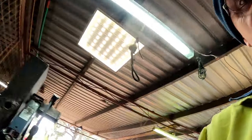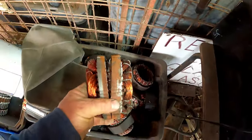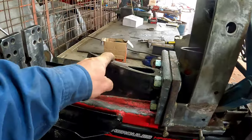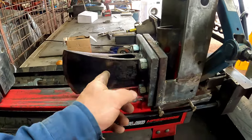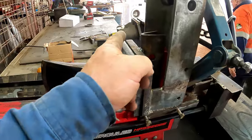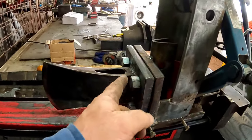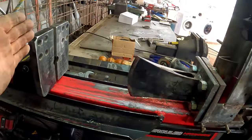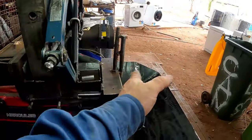I've done some modifications to our log splitter, what we use for extracting the copper out of the outer casings of the motors, like out of these. As you can see, it's partly split. I did a modification where I had too short of an axe head. I chopped it off because it was actually welded to here. It all comes back to I had more travel back here.